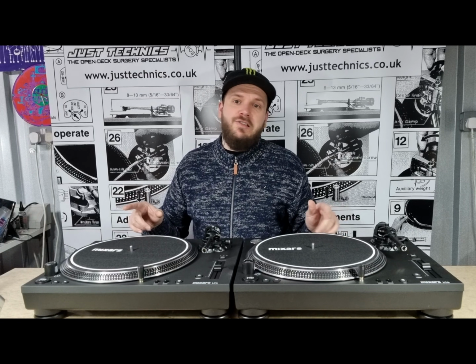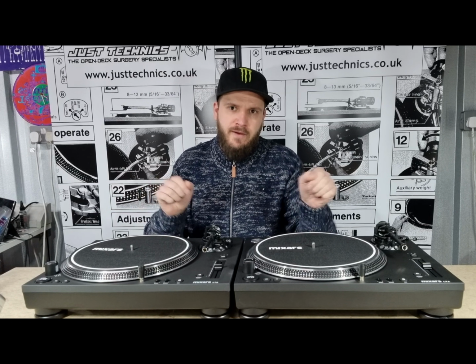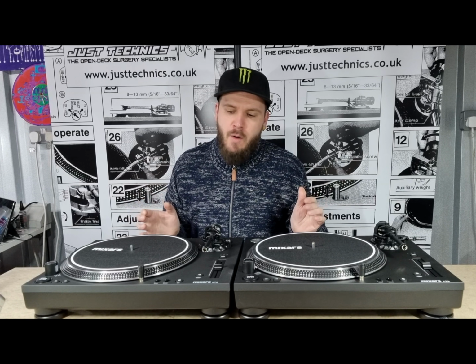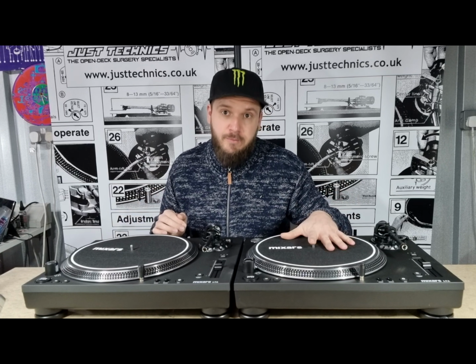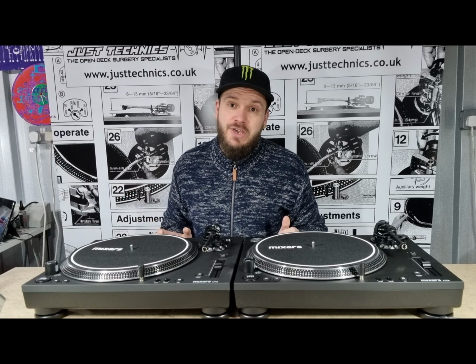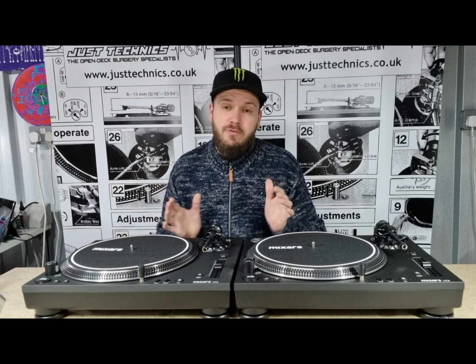So one minute you could decide, I want to use my Technics today, you go on to phono. If you want to use these the next night, flick them to line. Or you may even go, I want to mix one Technics with one of these Mixars decks. You can have one on phono, and one on line. So it's really, really cool that you can actually have a 4-deck setup with a 2-channel mixer.